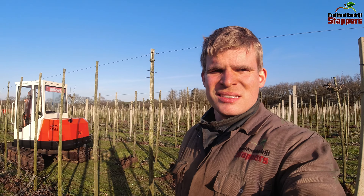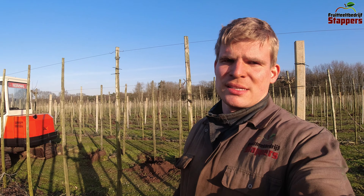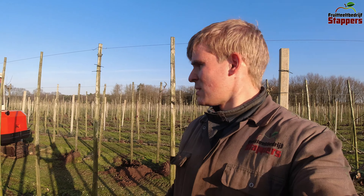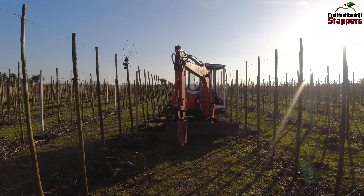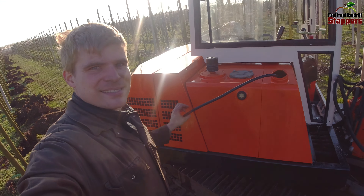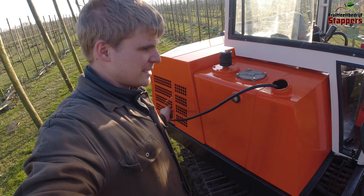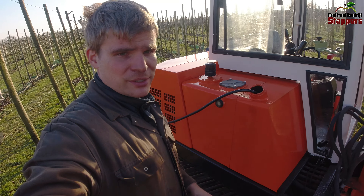I think some kind of mess or maybe rust came loose in the tank, because I did flush the tank a few times when restoring it, and yet I got a hose which is plugged. This is my bypass going into the tank here and then going into the fuel pump back there. I don't want to leave this setup when we go to other drops — I just want to get this row finished this way.